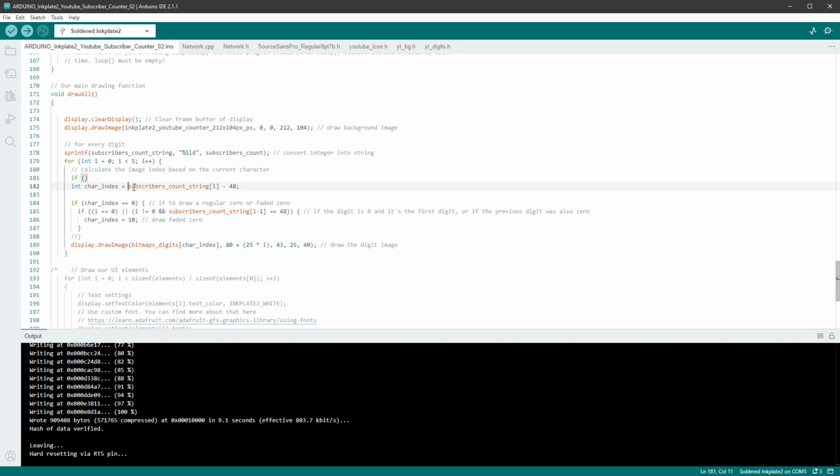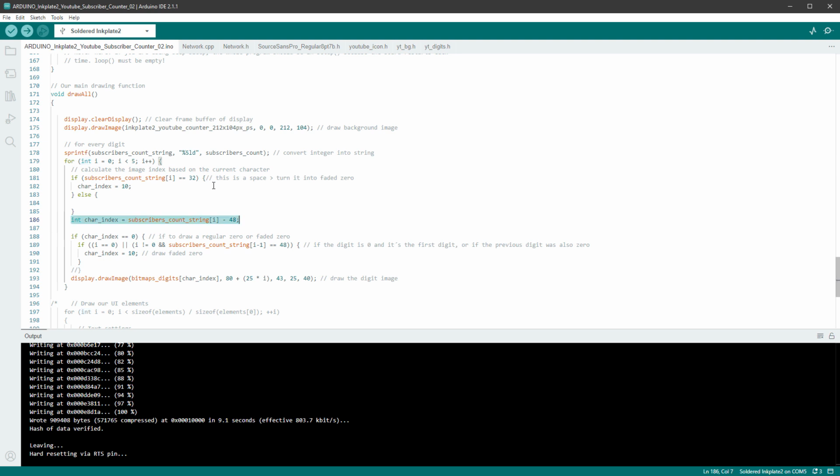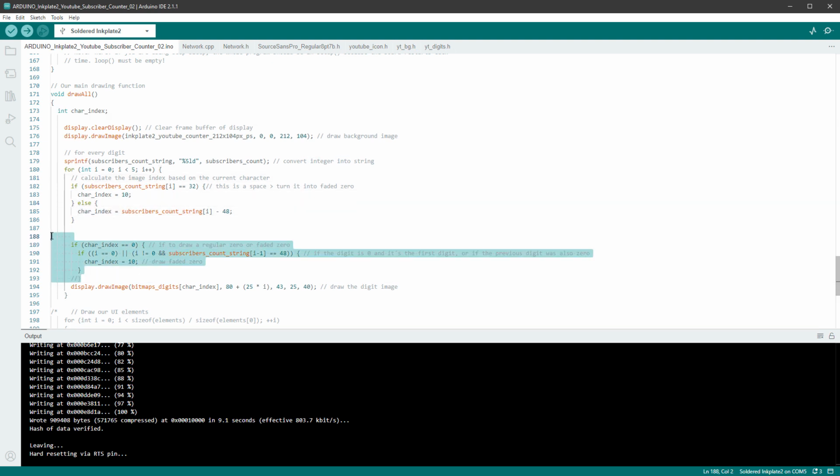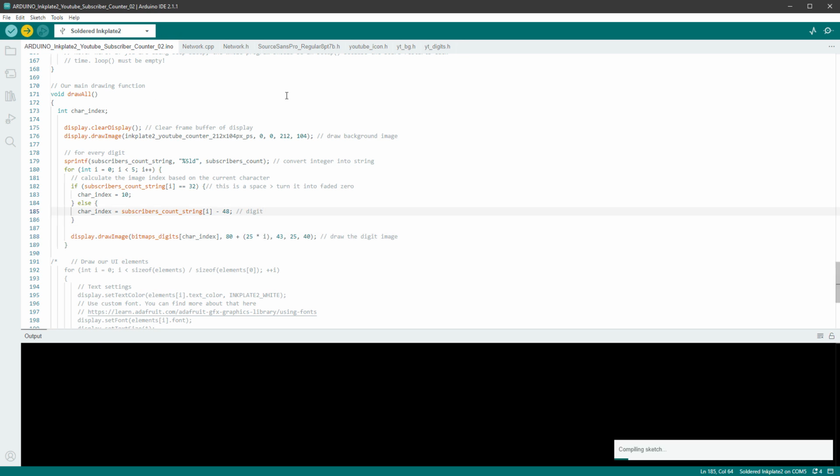We can say if the subscribers count string of the index i equals 32, in that case this is a space, so we will turn it into faded 0 by saying that the character index equals 10. If that's not the case, that's a number, and in that case we'll set the character index to be subscribers count string minus 48. That will be the same. I'll just define the variable outside of this loop, and then I can delete this whole section of the if statements. And that should be all that's needed, so let's press the upload button for the last time today, hopefully.